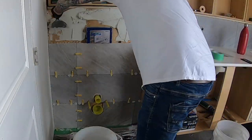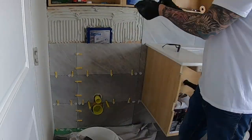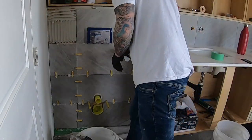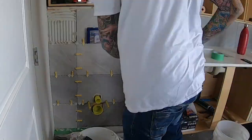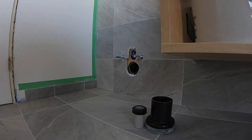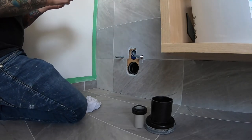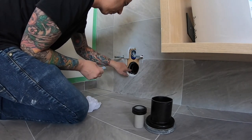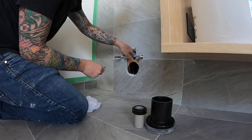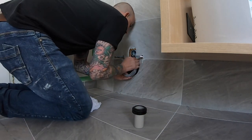On this project, I've got earth grey marble to install before I can finish with the bowl and dual flush plate. Look how important fastening that wall was — wall hung toilet and floating cabinet. Once tile and grout are finished, you will mark out the length to cut the two pipes that connect the tank to the toilet. These pipes slide into a tight seal on the tank and toilet. Use manufacturer's lubrication on the seal and pipe to allow it to go together with ease.